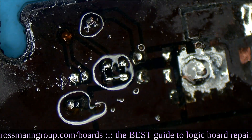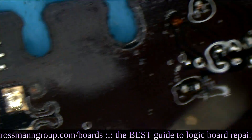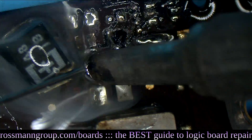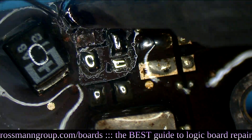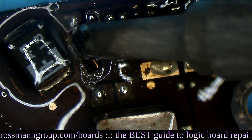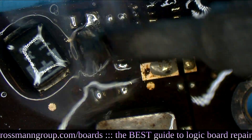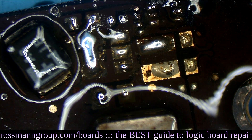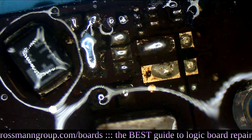If they're fixable, they're fixable — and if they're not fixable, we give them to Paul until they are fixable. We're just going to scrape away all that nasty rusty corrosion. The flux on the board, combined with the flux inside the solder, combined with the scraping motion, is going to remove a lot of that junk. It's going to pop right off and make our board nice and clean.